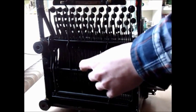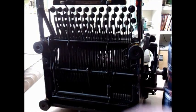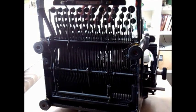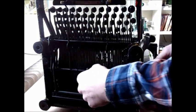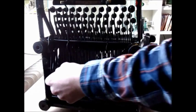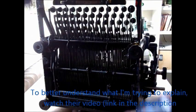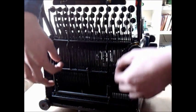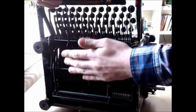That way the computer knows what letter to type. To make it in the fashion that USB Typewriter suggested, it would be just a bar that exists in the typewriter, going up here and into the typewriter. To move the space key down, fold the lever with the circuit board up onto here, reinstall the space key, and there you go.